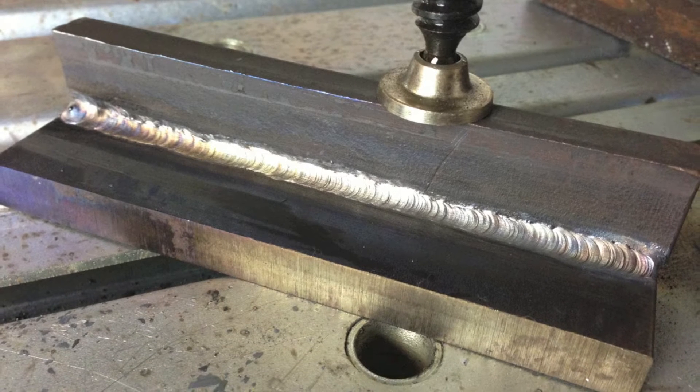Here's what I had after the first pass. Using the lower edge of the first weld as my center line for the second pass, I proceeded to fill in and make a second weld that would be halfway onto the base material and halfway up onto the previous weld.